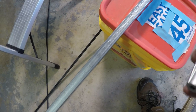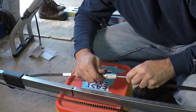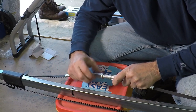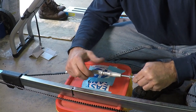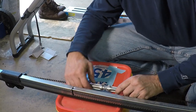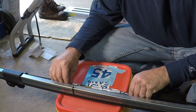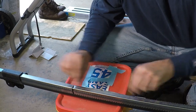You definitely need two hands for this - I'm going to put the camera down so you can watch me do that. This connector joins both sides. The screws are threaded in the opposite direction so that when this thing spins, it's tightening down on both of them. You're supposed to hold onto it and spin it with your hands because you don't want it spinning the belt. It's at least tight enough now so the belt won't come off and the pieces won't come out again.